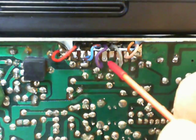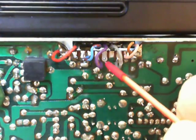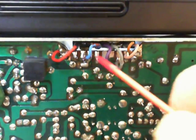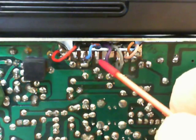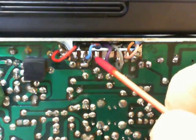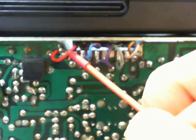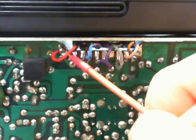Pin number 6 is not connected. Pin number 5, the violet wire, is the filter directly close to the capacitor — 47 uF. Pin number 4 is connected to the board at pin 4, and it's the input directly from the volume knob, from the microphone pre-amplifier. Pin numbers 2 and 3 are not connected.